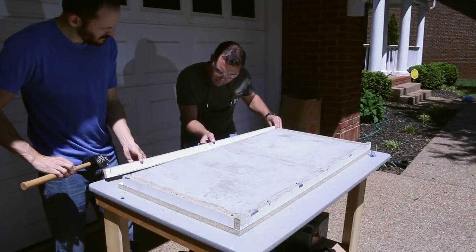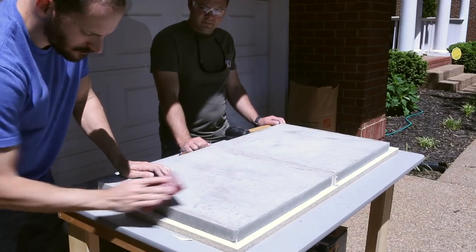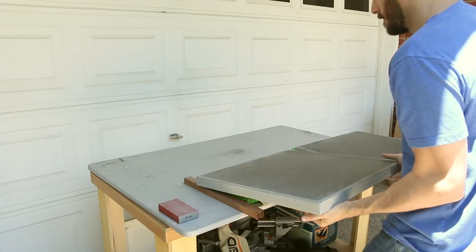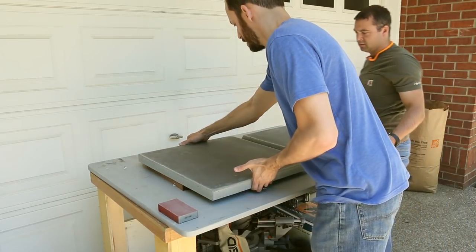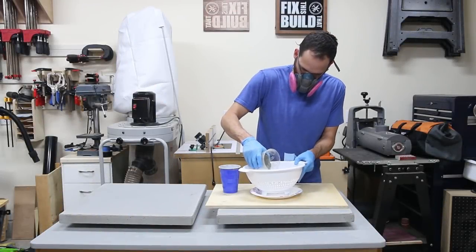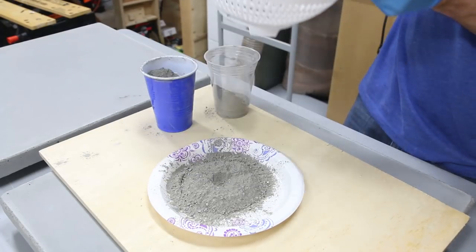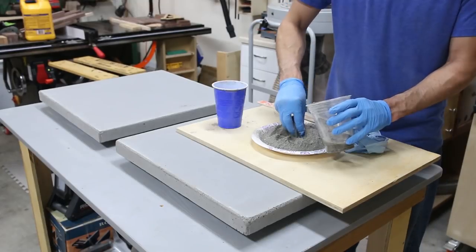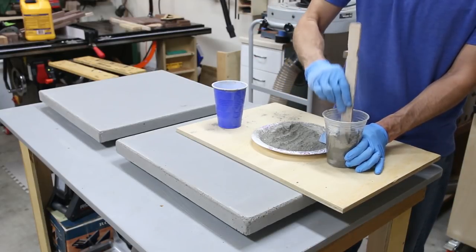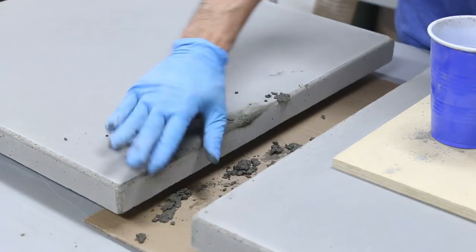The next morning Pete was back and we took the concrete out of the forms. We removed the sides and I sanded the edges with 120 grit to keep them from chipping. We were in a time crunch so we probably took these out a little early — you can see how wet the top still was. To help them dry faster we flipped them over onto scrap pieces of wood to let air flow all around the concrete. The corners and edges had some voids from the form, so I used a little leftover concrete to fill the holes. I took a colander to sift out the large aggregate and made a paste to apply to the needed areas. Last time I used Portland cement for this and I'd recommend that route or using a finer sifter — it was harder to apply than expected and took more time to get into all the little holes.